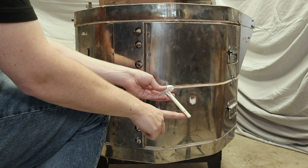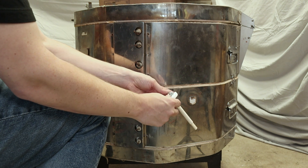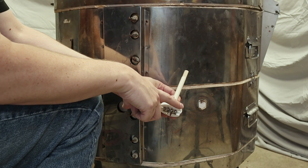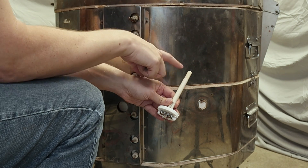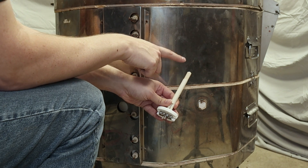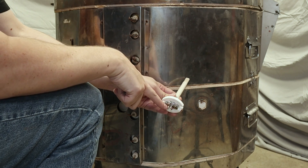Here is the thermocouple. It is a K-type thermocouple. I have a thermocouple block to attach it to. The lead goes out through these ceramic pieces to the end, where the two dissimilar metals are connected — that's how it reads the temperature — and the other leg comes back.